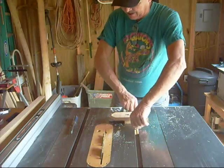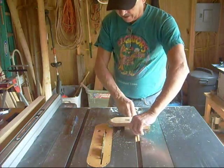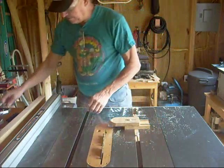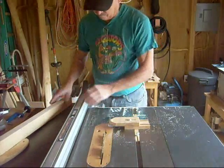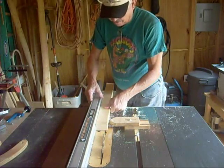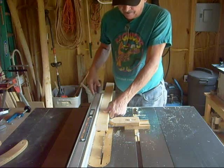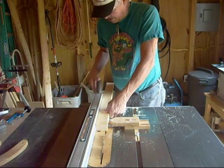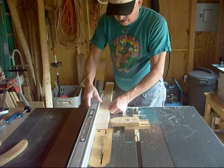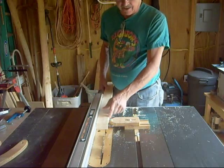Through the planer anyway. Now, take this and set it behind your blade always. This is a handy jig to have. Now, what you do is set your workpiece to the jig, because that roller is about 3/8 away from the blade there. I can make it a half inch, or make these any size you want. Now, you see that? I would cut a thin strip like that.